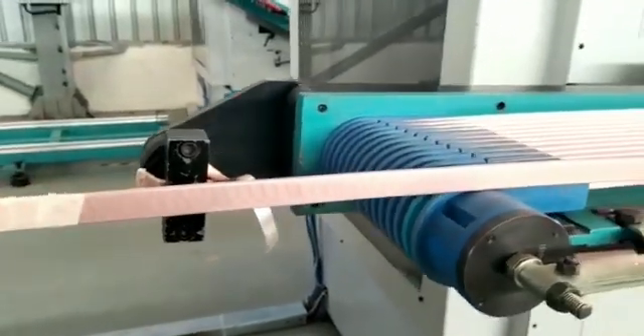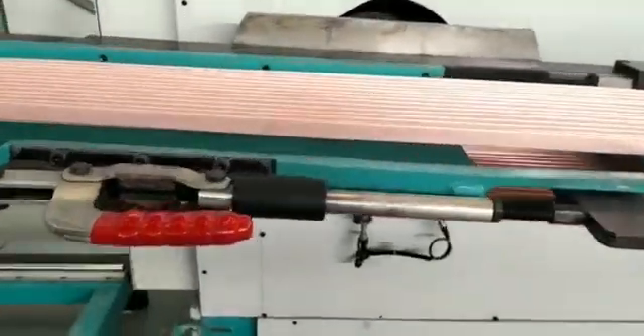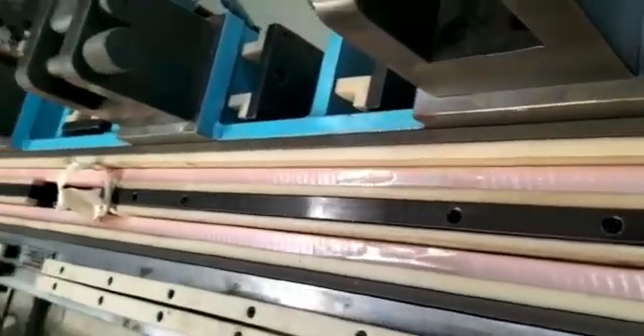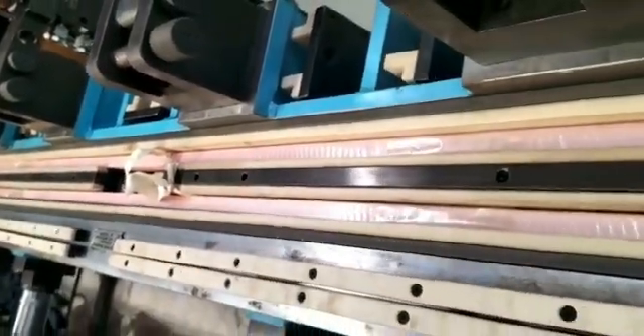The machines are extremely sophisticated with lots of nuances and finer points, taken care to ensure that the conductor drawing tension is maintained uniformly for both the bottom and top conductors. These conductors are drawn from two different bobbins, whose brake pressures are varied to maintain and ensure consistent loop winding.